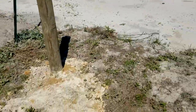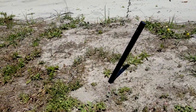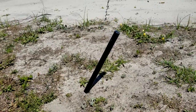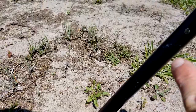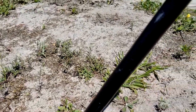Alright, there's my end post, and like I said, I went back four feet. You can see I drove this rod into the ground at about a 45-degree angle and left about 10 inches sticking out. There's a little hole right here and up here that I'm going to use to run my wire through, and I'm going to show you how to do that.